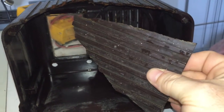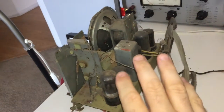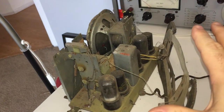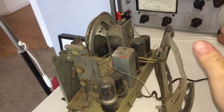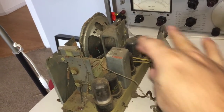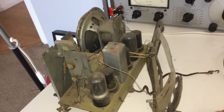After about six or seven days it'll be nice and dry again. I could almost bet that once it sits, I can blow it out, clean it up, get all the dust out, and the electrolytics are definitely garbage. I'll test the non-electrolytic capacitors, maybe find a couple of dry ones to make sure they're okay, test a couple of voltage-dropping resistors to make sure they're still good, then tune the cans on this radio. I bet dollars to dimes this thing comes right up like it's nothing.